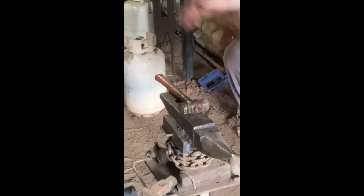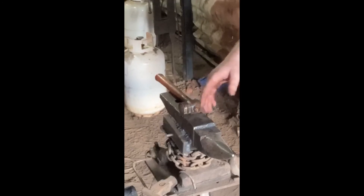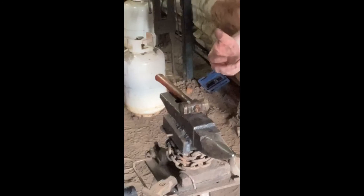There's also what's called dirty welding — done at the anvil with the heat. You do a three-quarter cut, then fold it, give it a quick brush, throw some borax — a lot of people use anhydrous flux — down on there, then close it up real quick. It's called a dirty weld because you're not taking the time to really clean your steel. I've had really good success with it, but it's still literally playing with fire.